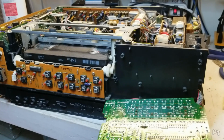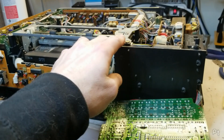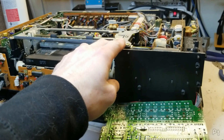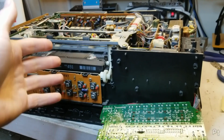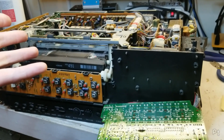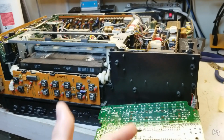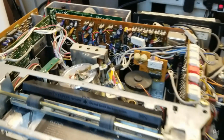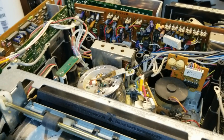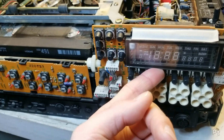So these old machines are really not worth all that much if they need work. Because there's the cost of the belt kit. There's the cost of your time troubleshooting any electronic gremlins. There's other unforeseen problems that could make the whole thing worthless. There's always that risk, if there's a damaged head or rotary transformer or a busted VFD.